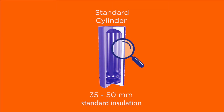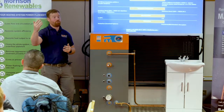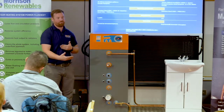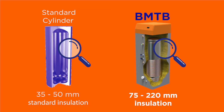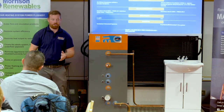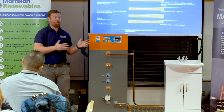On the cylinder itself, normal cylinders are cylindrical within cylindrical cases and normally have between 35 to 50 millimetres of polyurethane insulation. One of my big bugbears is heat loss — normally a cylinder will lose anywhere from one and a half to two kilowatt hours every 24 hours, or up to three or four kilowatt hours every 24 hours depending on how old your tank is. So we asked: what if we made a cylindrical cylinder in a square case? We can have 75 millimetres of polyurethane at the thinnest points, and up to 220 millimetres in the corners. Compare 35–50 mm with 75–220 mm — we're ahead of the game. All that culminates in a heat loss value of around 980 watts every 24 hours — that's roughly a kilowatt a day against a new cylinder, more against old cylinders.